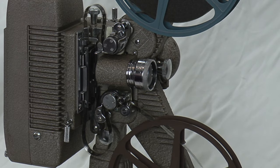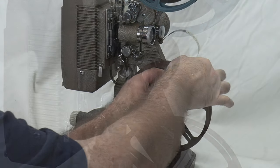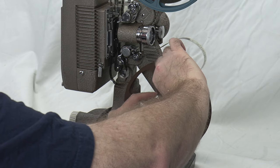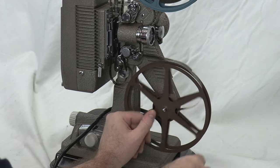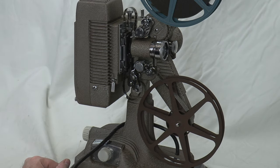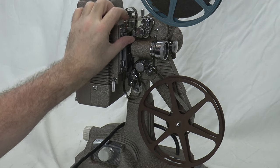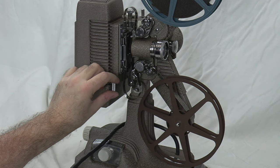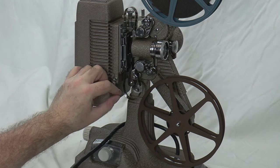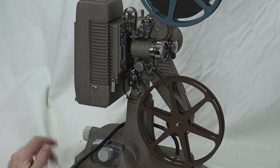As you thread you'll find that if you get some chattering, you'll want to make adjustments. We're going to put the leader — this is sort of commercial film — just roll that to start. Now we'll turn it on and see where we are. Everything's closed — both capstan locks are tight against the capstans and the film pressure plate is closed.